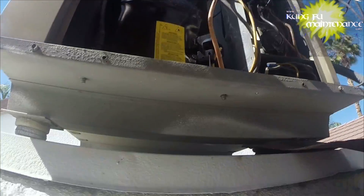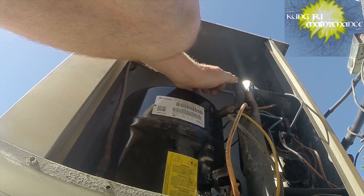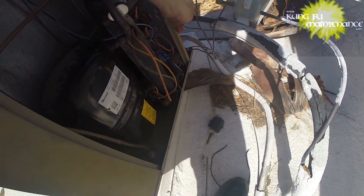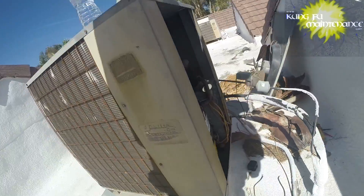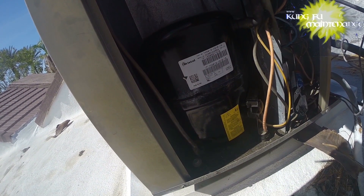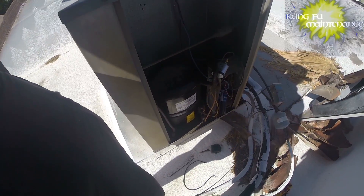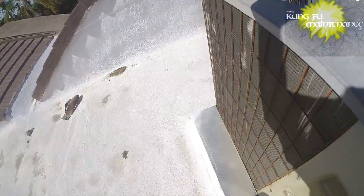Very strange. Looks like a new compressor. It's possible it's low on refrigerant and froze all the way back. I'm going to go check the indoor coil to see if maybe it's frozen inside, and go from there. It's all working good.